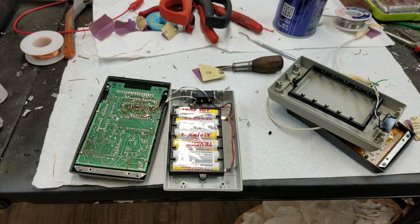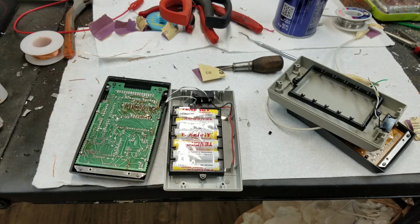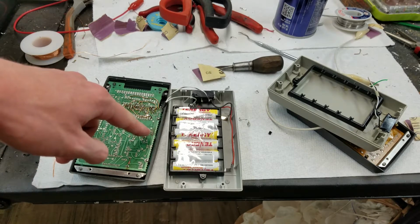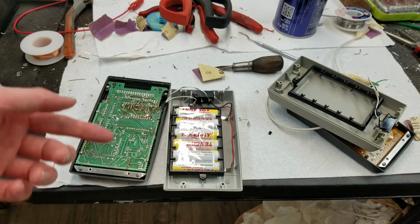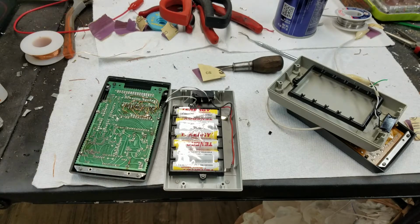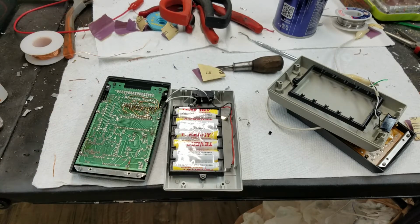I should say the display sleep mode. Because basically that's that same trace that is listening for the key presses. So basically feeding battery positive in there, you're holding that transistor on all the time, and then that cap is never going to charge up and it's never going to time out the display. So I took that out. I don't know where it's supposed to go.